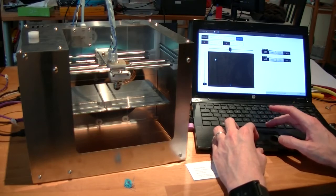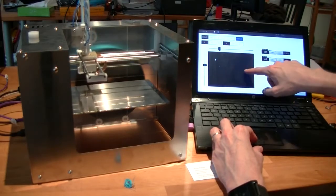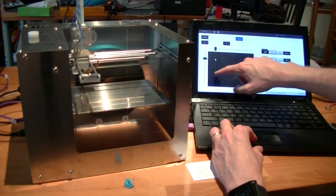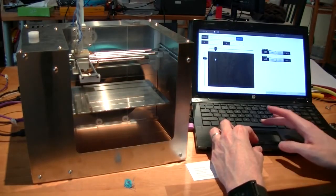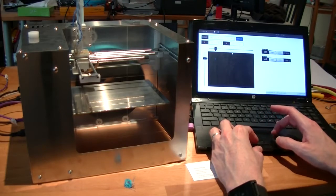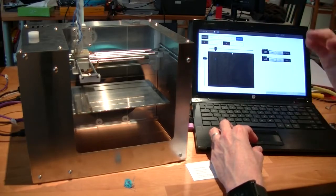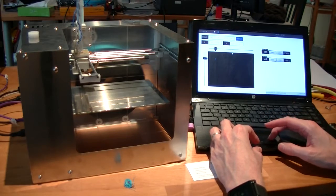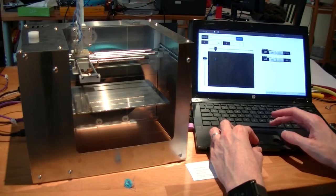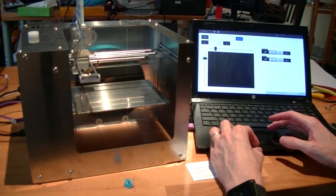So generally what I do is I move the hot end to here, here, and here, and I tighten or loosen the screws on the bed in those areas as is needed. To start with, go on and kind of tighten the screws down a bit so that the bed is below the hot end on all sides. If this is the first time that you're doing this, be careful about setting the Z height until you know that it's going to clear.